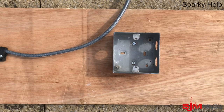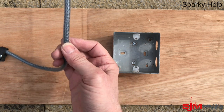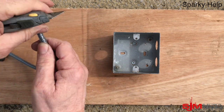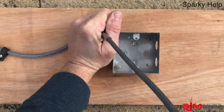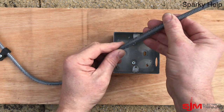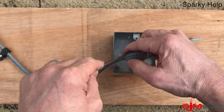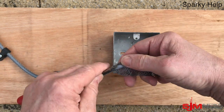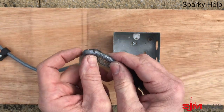Here's Method 2 — this is what you will not do in the AM2, but I'm sure there are lots of people out there that do use this method. So here's our cable again, terminating into an enclosure. I'm going to strip round and take that outer sheath off. This cable was a real nightmare to strip. This time what we're going to do is push the braiding down, use a screwdriver to create an opening, then bend the cable and loop it through, basically pulling the conductors through this hole in the bottom.